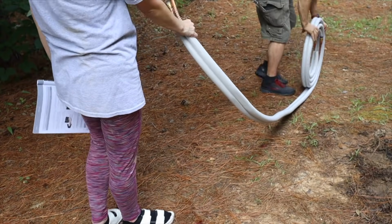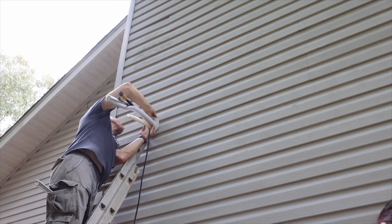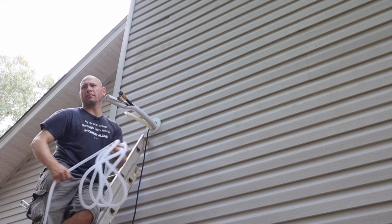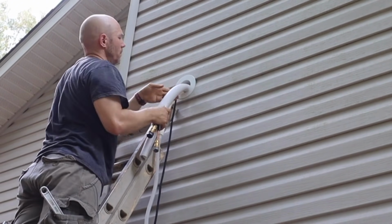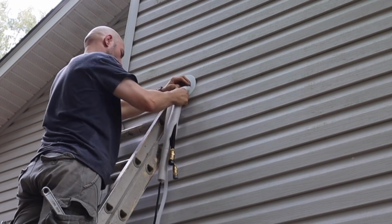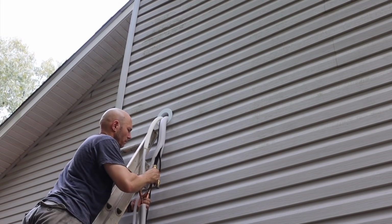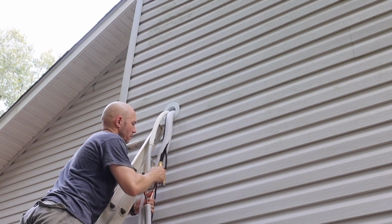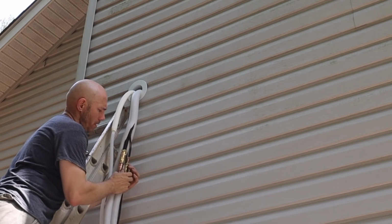Once the interior unit's hung, you just go out to the outside and unroll this supply piping. I put on this collar and then started connecting the drain line, and then these two refrigerant lines. I was careful and bent them down facing the ground and started connecting the lines. They're easy. There's no way to mismatch these. They're two different sizes, so you can't accidentally put one in the wrong place. And they're really easy, a couple of adjustable wrenches and everything tightens up.